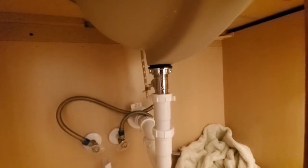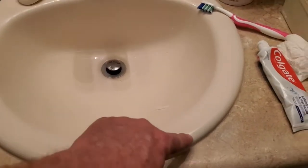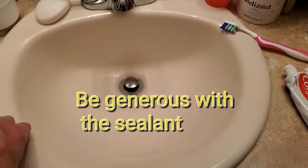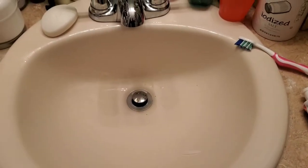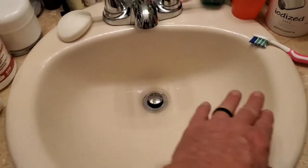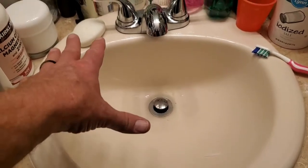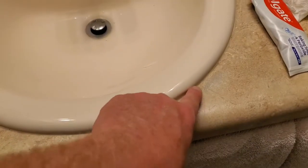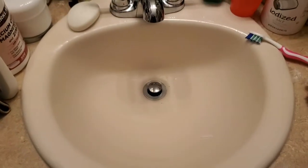I think we have a winner. Following up on this sink: to put the sink in, I laid a bead of sealant around the sink opening, set the sink in, aligned it with the plumbing, and tightened everything down. There was a slight high point causing it to rock left to right, but when you put your caulk in there, let it set up — don't touch it, I left it for 24 hours. Now it's nice and solid with no rocking. I put a bead around the edge and used a wet rag to trim it out. Looks good — finished sink.